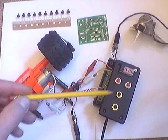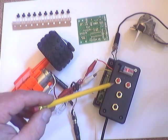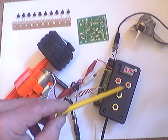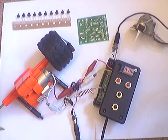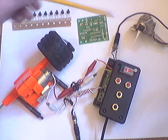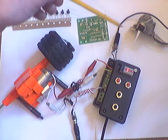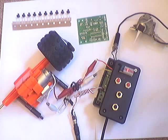So what we have here is the unit itself. We have focus in, focus out, speed selection, and motor selection. We've got two motors: an old Tyco motor — actually out of a hijacker car, startup current about 1.25 amps, run current about 450 milliamps — and an old gearhead motor that I use on my telescope, startup current about 100 milliamps, run current about 40 milliamps.